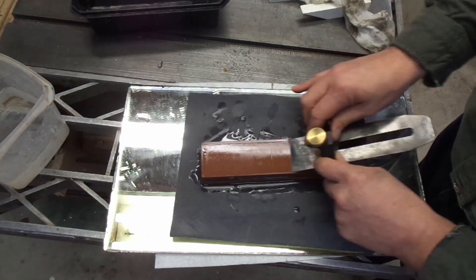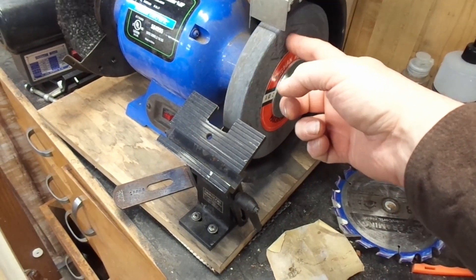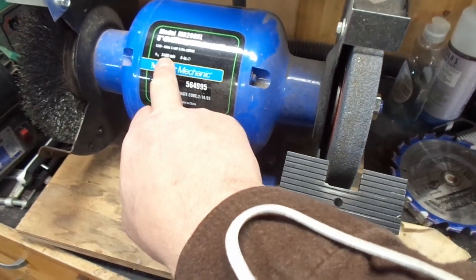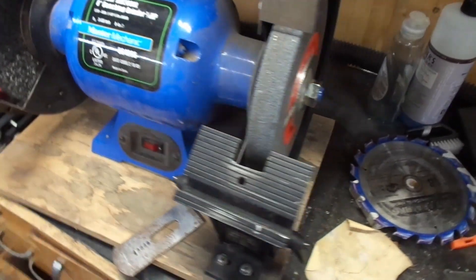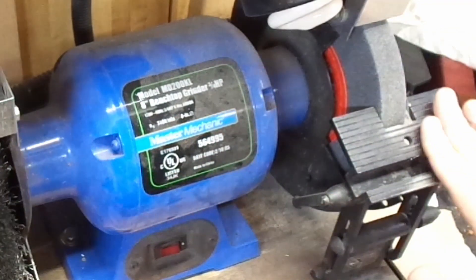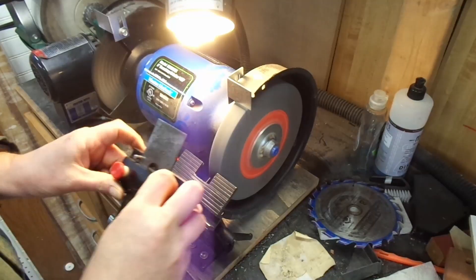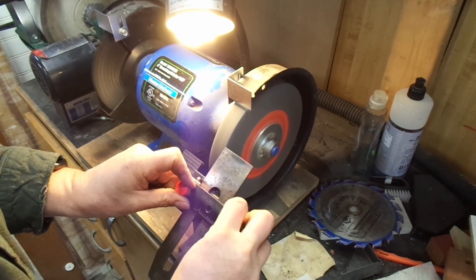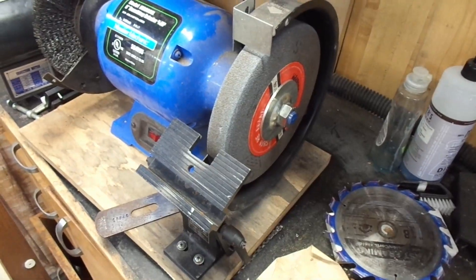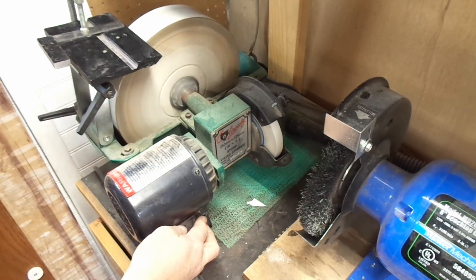I find that fine stones are good for honing, and coarse stones are good for moderate material removal. Personally, I have a fine-grit whetstone that I use to polish the edge of my irons. Then there are wheels, which are really just stones of a different shape. Wheels vary from aggressive to very aggressive — they can be wet or dry, and range from inexpensive to very expensive. Diamond wheels are in another category and are very expensive. If you have a wheel and plan on using it, get a guide for it. Unless you can freehand achieve a 25-degree grind, you'll need a guide. Grinders are very good for heavy material removal — redefining the bevel angle or grinding away a blemish. I have a cheap coarse stone for redefining an edge and a fairly pricey wet stone for actually putting on an edge, though it's not as perfect as flattening on a plate.